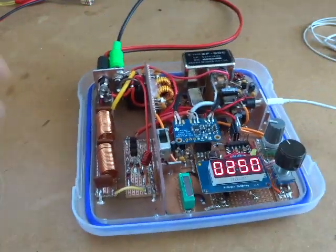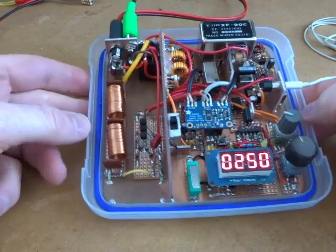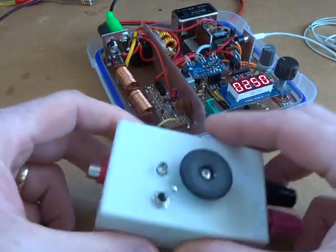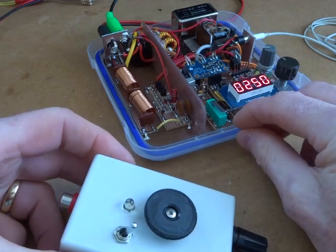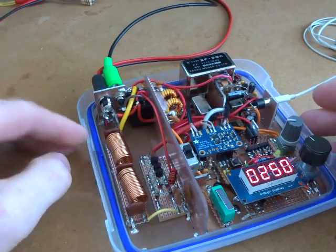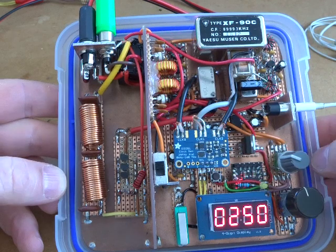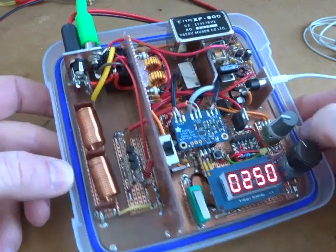The next steps now for this radio would be that when we go tramping in New Zealand, quite often the available room to put up a large antenna isn't easy, especially with a big half-wave dipole. So I do want to play around more with random wire antennas. Before summer comes around and we get back into tramping, I want to look at some kind of random wire antenna and an antenna tuning unit, just to bring that back down to the desired 50 ohms that this wants to see. I'll probably do some transmission tests here if I can — get the old reverse beacon network and see if I can ping that.